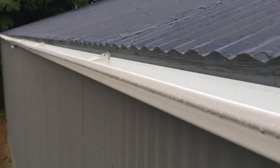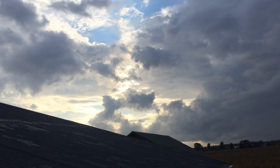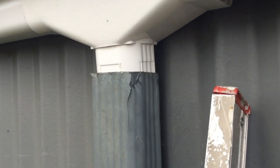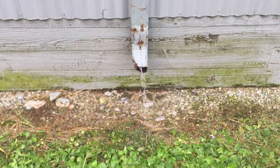We're all done up here, and it looks like a nice day over there, but we're going to get a test really soon. I apologize for this rusty old gutter pipe, but this is all I had. Downspout goes on here, held on with a gutter screw. Make sure to put a splash block down here, or you'll wear a hole in the ground.